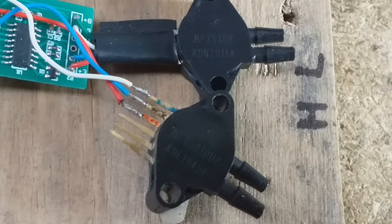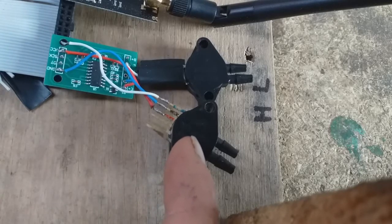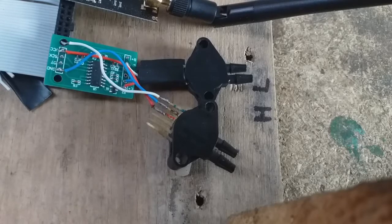When it arrived it did indeed have a very small voltage output. But for the power meter project I've been experimenting with amplifiers and ADCs, so I thought why not connect up one of these boards here which has an HX711 chip on it. Those things are specifically designed for measuring the voltage output from strain gauges, and I believe these pressure sensors do indeed have strain gauges inside them. You have to connect it to channel B because that has a maximum voltage range of plus or minus 80 millivolts, whereas channel A gives higher resolution but a smaller voltage range.